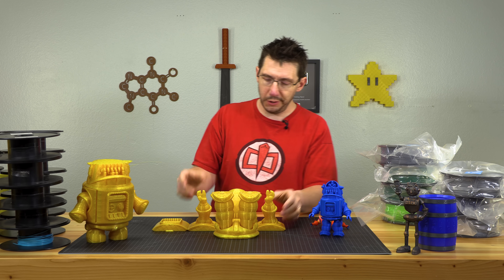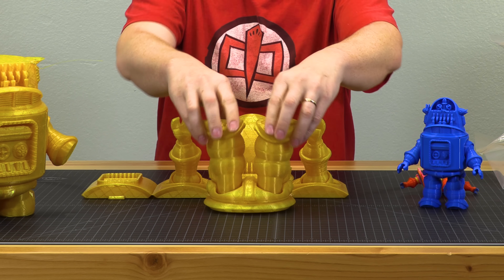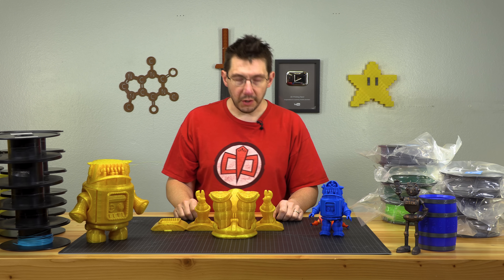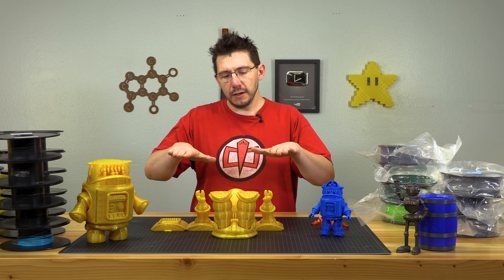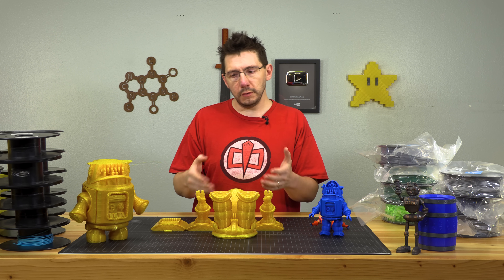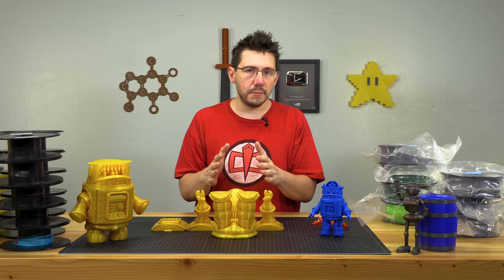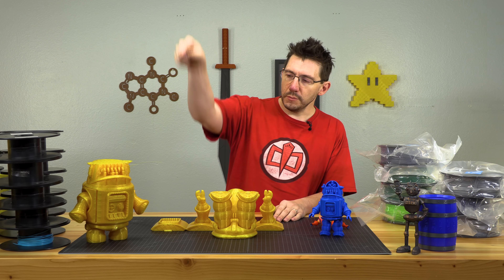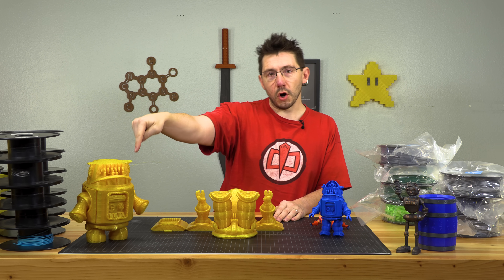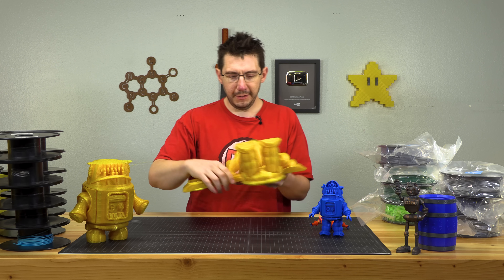What's really cool when you size something up is that the clearance between pieces — as long as your tolerances are good — means things move around and rotate much, much easier. However, because we're scaling this up, the plastic joints being created with PLA material are thicker, which means they're going to be harder to bend or potentially more brittle and may break.